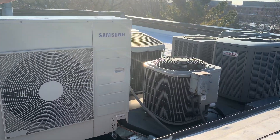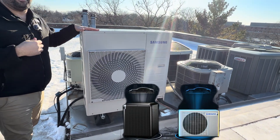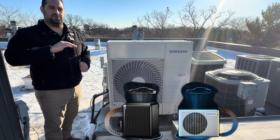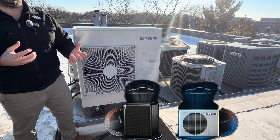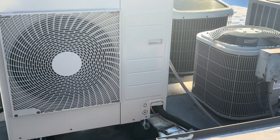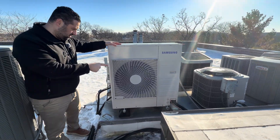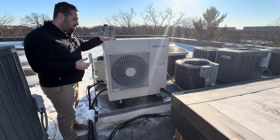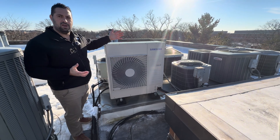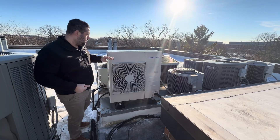There are substantial savings on both heating and cooling. Moving to comfort, the variable speed technology provides much more stable temperature management, as the unit doesn't need to provide full heat or nothing at all — it's constantly adjusting, giving you a much smoother sensation from your heating equipment. Rooms are going to be more consistent across the home, and temperature is more consistent from time of day to time of day — a much better experience overall. In addition, the inverter technology for cooling is going to provide much better dehumidification — typically 200 to 300% better humidity removal than a single-stage air conditioning unit, as the unit runs for longer periods at lower capacities, giving a better opportunity to remove moisture.